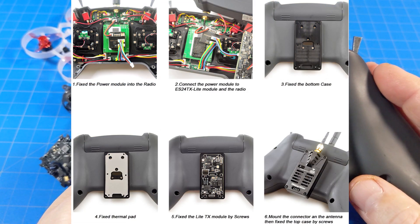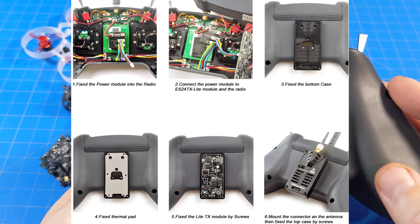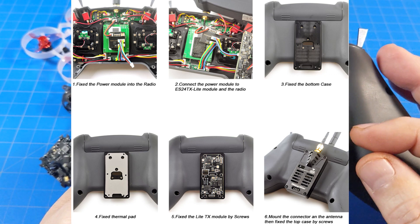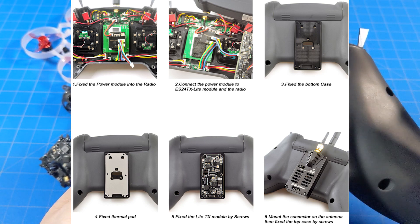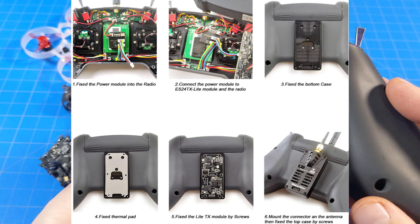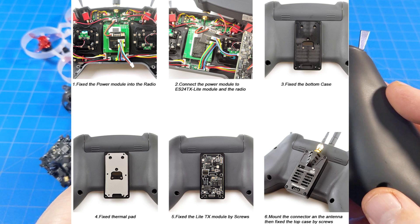You open the two halves of the shell, you go in with this little power module board, you stick that to the back of the radio — the actual radio module. I do suggest sticking that up a little higher. There is a softer foam piece that's in the back shell of the radio that's round, and if you mount that little connector too low, you'll find that foam has to squish harder. I mounted mine in that location, so I'm advising you mount it a little higher than you think you need to, so that foam bit that's part of the radio will clear your wires. It's really plug and play — you plug in the wires as you see in their pictures on their website.